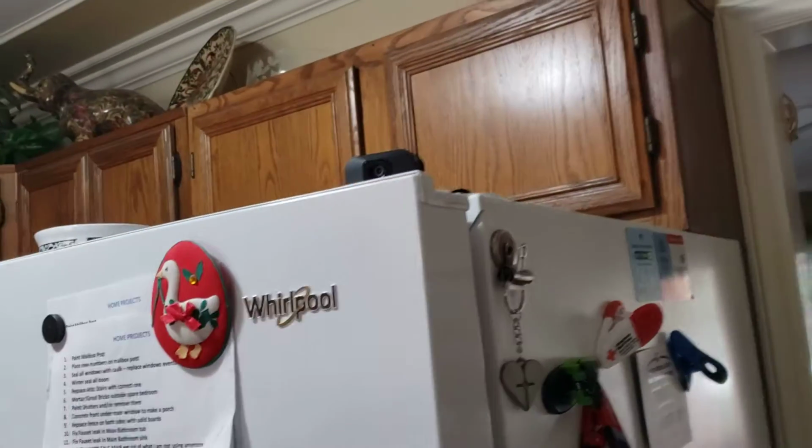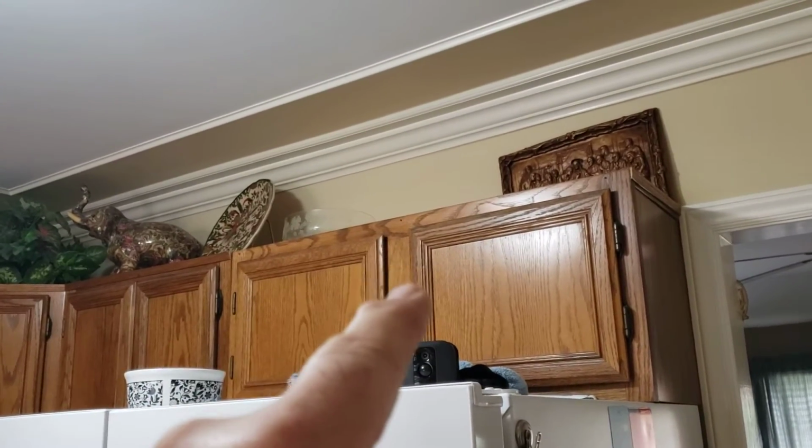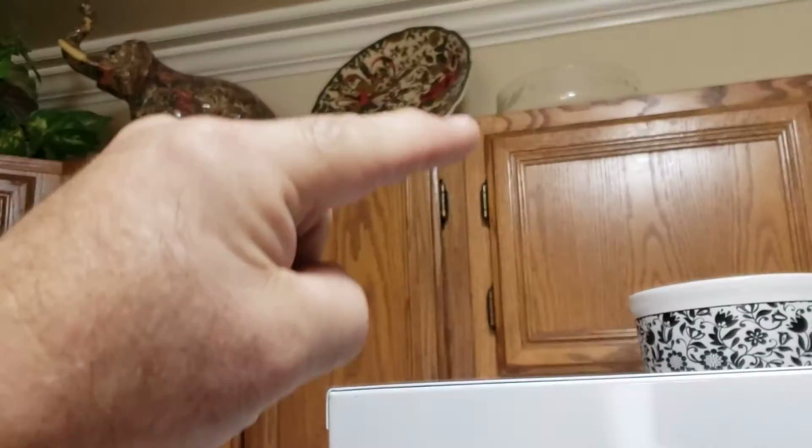Well, that's not a real classy look as far as what to expect with the cabinets. So we need to change the width on this to 35 inches. At the same time, we'll add a small 3¼ inch filler right here to push us over to the side of that. We still want the end of this cabinet flush though, so that the crown molding would make a nice return without any kind of step out with the moldings.